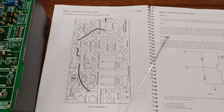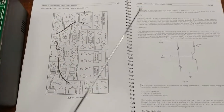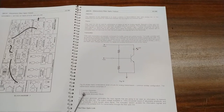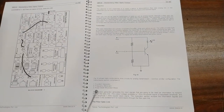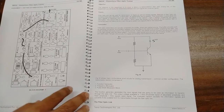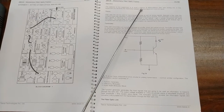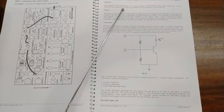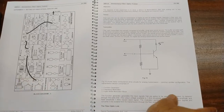Now we will start with the first experiment: setting up a fiber optical analog link. We will make the circuit as given in the block diagram — the theory about the fiber link is also given in the user manual. For this we will require the function generator block, a frequency modulator, and a pulse width modulator block. The objective is to study the 660 nm and 850/950 nm fiber optic analog link.